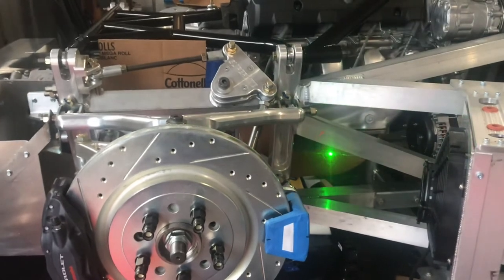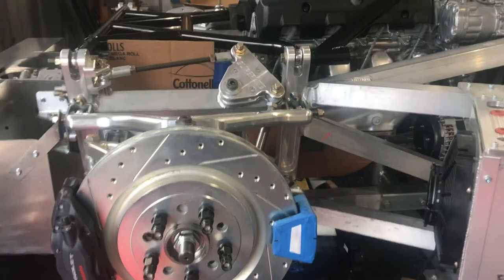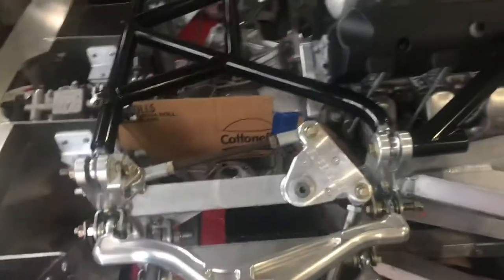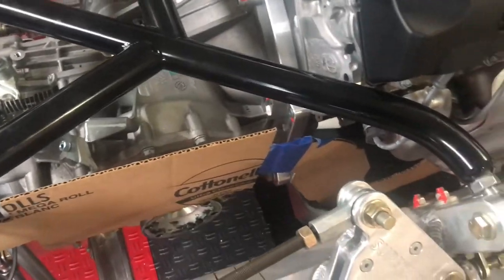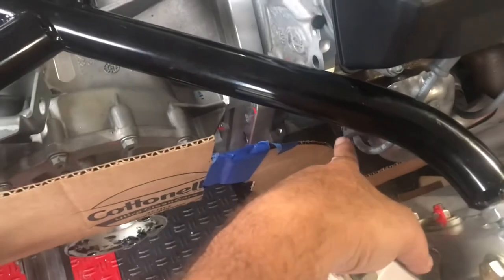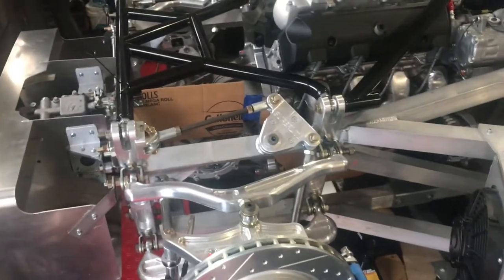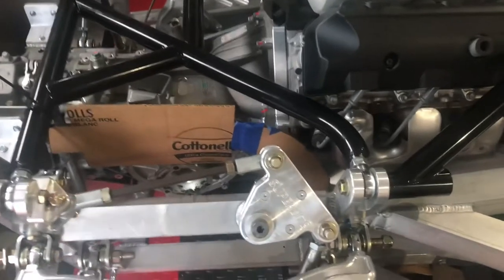Here's the template mounted in the car - just taped in. We've got the downpipe, then behind there is the catalytic converter, then the ultra quiet resonators. This is just 2D so I could have some challenges with the cat being too close to some wiring and sensors, and maybe some bolts in the way. Now the hard part - we're going to make it up out of metal. First I'll show you the different components and the brands of parts that I bought.